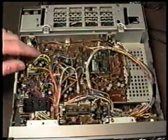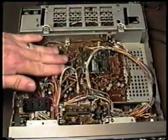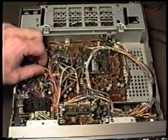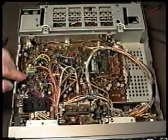We're now looking at the top of the IF board again, and let's assume that we've been able to push and pull on this board and we've seen a drastic power drop, let's say from 100 watts to 10 watts, or it was only working at a 10 watt level and it suddenly jumps up to 100. Then that indicates a problem in this area.